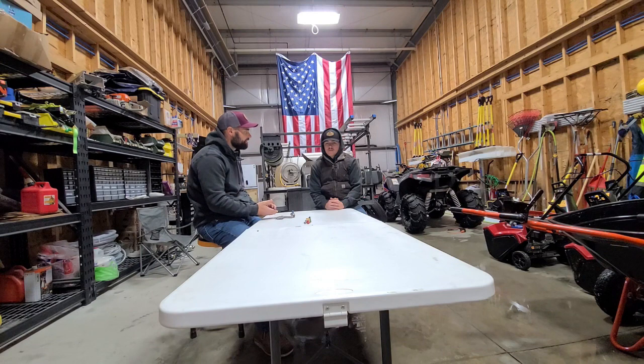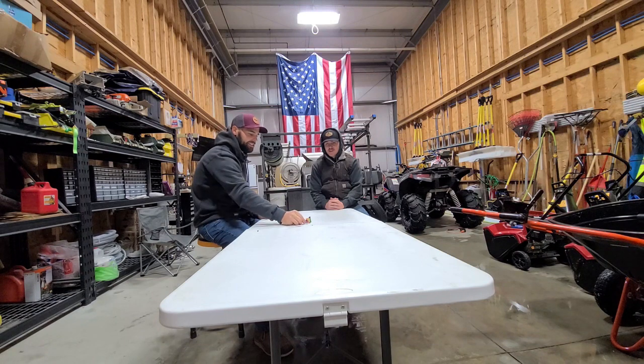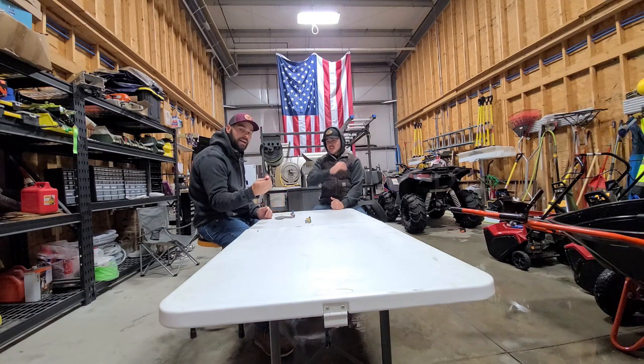How often should they use the red tip, Seth? Never. You should throw it away. Absolutely. As soon as you get the unit. It's actually a little concerning that we have one of these in the shop, and I'm glad we do for the video today, but whenever we get a pressure washer, we take the red tip and just throw it out.